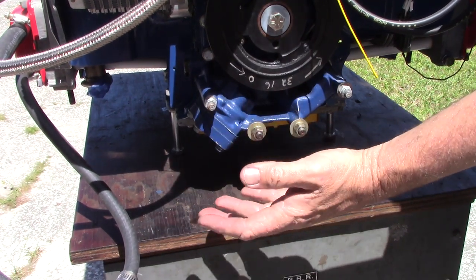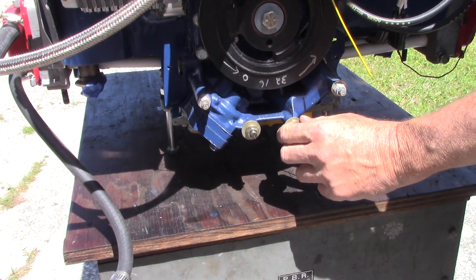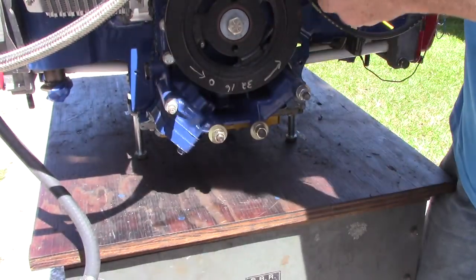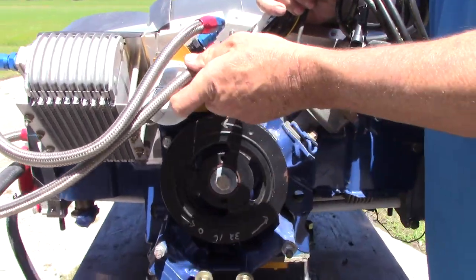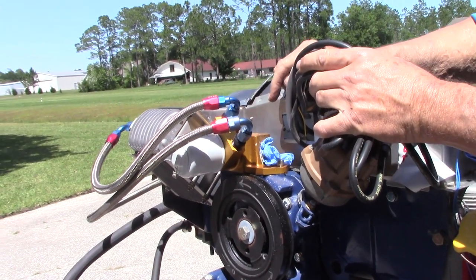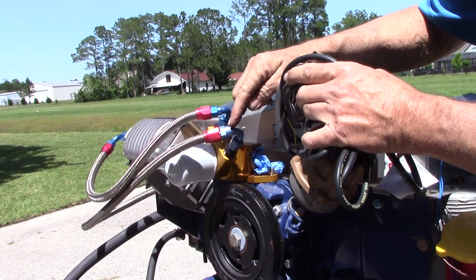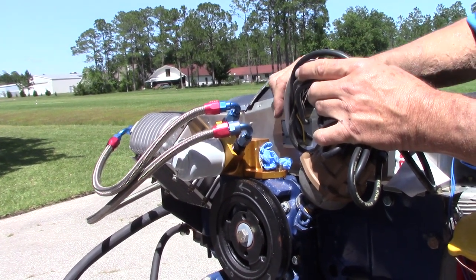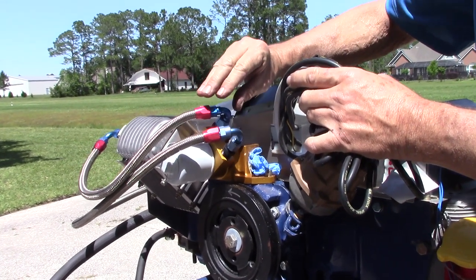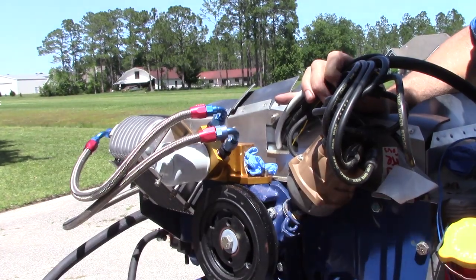The intake manifold was taken off this engine. Looking at the nuts and washers — they are not the correct ones. There are thin nuts that are applied and not taken off. The outer locking nuts would probably be okay. Coming around here: that's an Earl's swivel seal hose end — look at the difference in size and shape. The other one could be Chinese or whatever brand. Having one correct hose end and one incorrect one is beyond me. Use Earl's hose ends and Earl's hose. All of this can be corrected, but it needn't have been assembled this way.